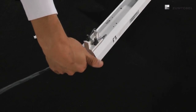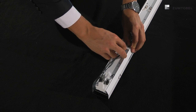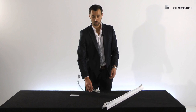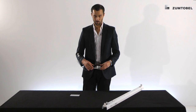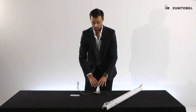You just need space to put the wires on the other side. To fix the wires on the back side you have a small piece — you just click it in and put the wiring on the back. It's very important to have it very smooth on the back because you have to connect to the next terminal block, which is available and driven by DALI. This tool comes with two features: presence and daylight detection. If you want only one feature — the presence detector — you can get rid of the daylight detector.